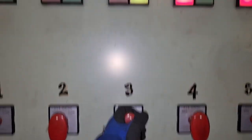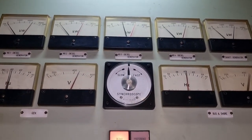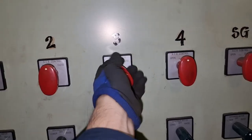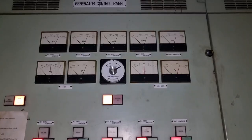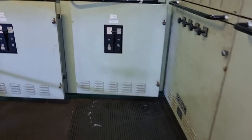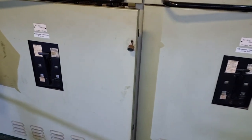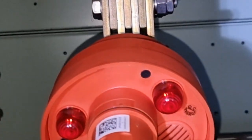The last thing we needed to do is open the air circuit breaker of the running generator, causing us to lose power on the main switchboard. After that, I racked out the remaining ACB, earthed it, and then did a no-voltage test on each phase to ensure that there is no more voltage present in the bus bar.